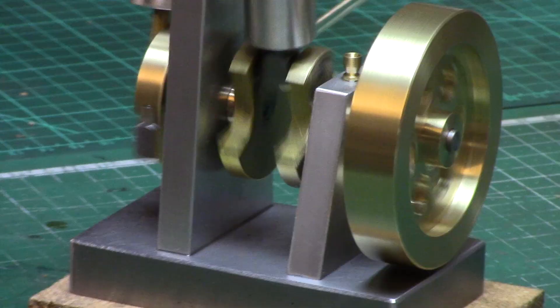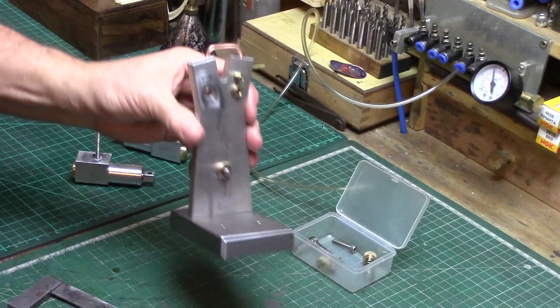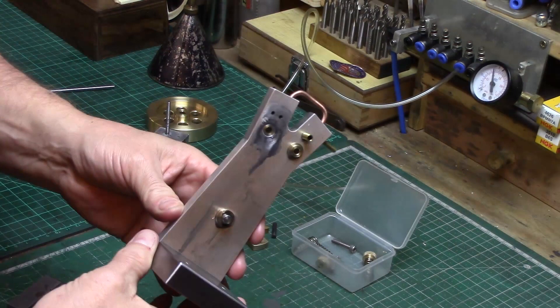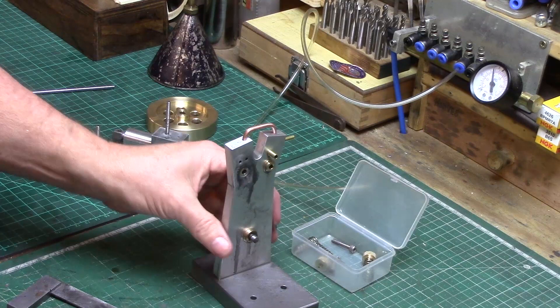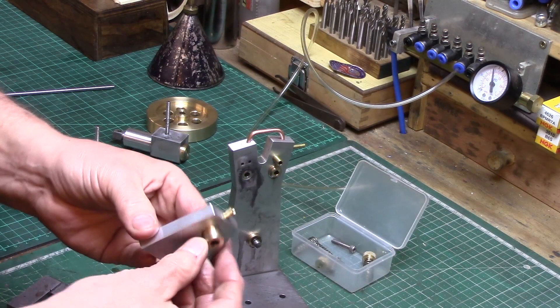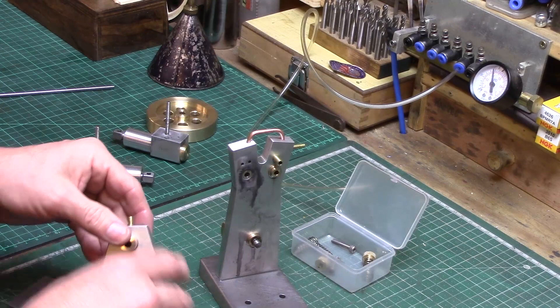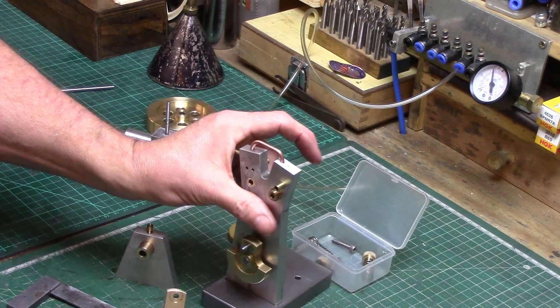Normally when I build one of my wigwag engines I sort of put it together and everything kind of works. Well I spent all weekend trying to get this running and it just wouldn't run right. I wasn't sure exactly what was causing it - I went through everything. I thought maybe there was a slight misalignment in the bearing on the secondary side, so I remade the bearing in there just to make sure, but that didn't seem to work either. It just had a stiff point - well, two stiff points. I couldn't figure it out because everything individually was running absolutely beautifully.